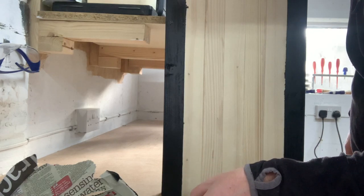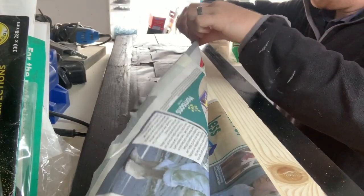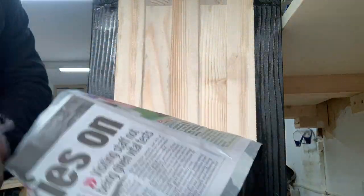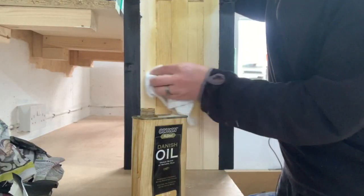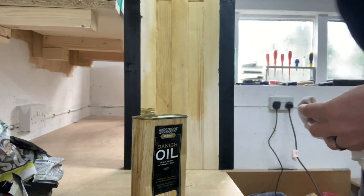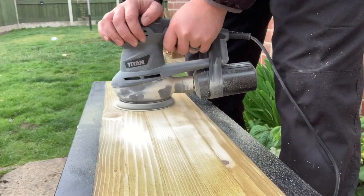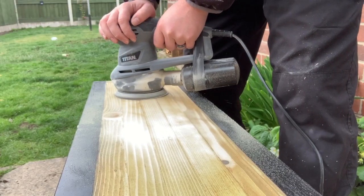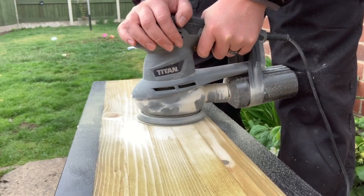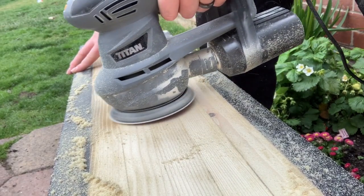The next day I came back and started to remove the newspaper revealing the nice crisp lines of the paint. I had a couple of spots where the paint had seeped under the tape. I wanted the finish to be a similar colour scheme to my planters — painted edges with an antique pine Danish oil — but as soon as I started to apply the Danish oil, I hated it. I decided the best way to salvage the bench was to strip it back to the original wood. I got all my low grit sanding discs out and went to town sanding away all the paint and Danish oil until I got back to bare wood.